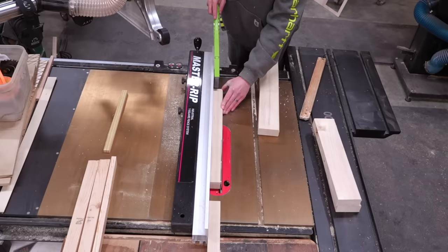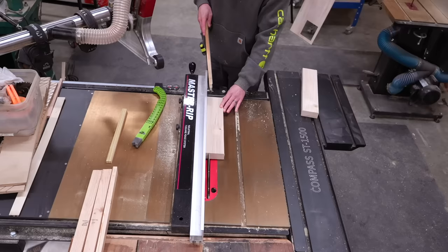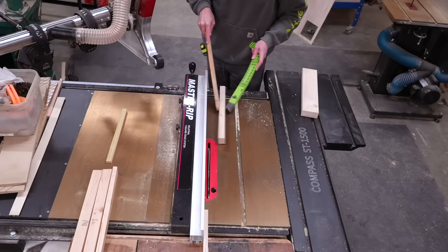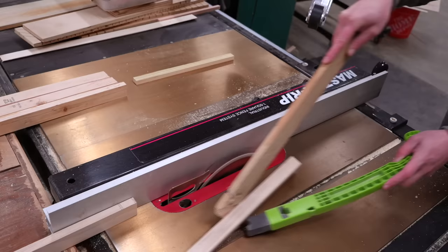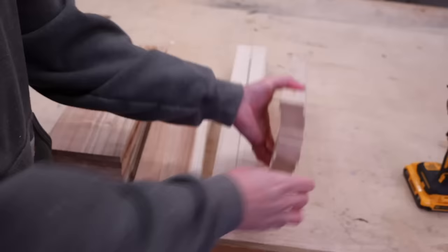We want these legs to have nice crisp edges, so let's cut an eighth of an inch off one side of our two-by-fours. Once we have a nice straight edge, let's cut our legs out — these legs will be labeled part A in the description. Sometimes these videos feel like old paint-by-number sets with everything labeled A, B, and different colors. Now I'm going to cut out the rest of these parts. People ask why I use my push sticks like chopsticks — for smaller thinner parts it gives me more control and keeps my hands away from the blade. With our legs and crossboards cut, let's put some pocket holes in the crossboards.